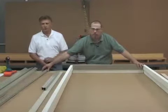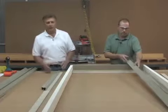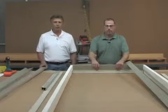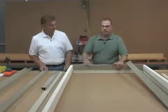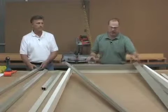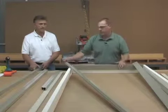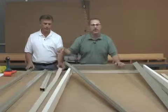If in the future you would ever change your door spec for any reason, or change your sill or your wood supplier such that it would change the specs at all, we need to know that so we can change the specs on our end. The three basic most common shapes to clad a door unit are the jamb cover — this is a four and nine-sixteenths — the brick mold profile for the nosing, and then of course the nail fin.